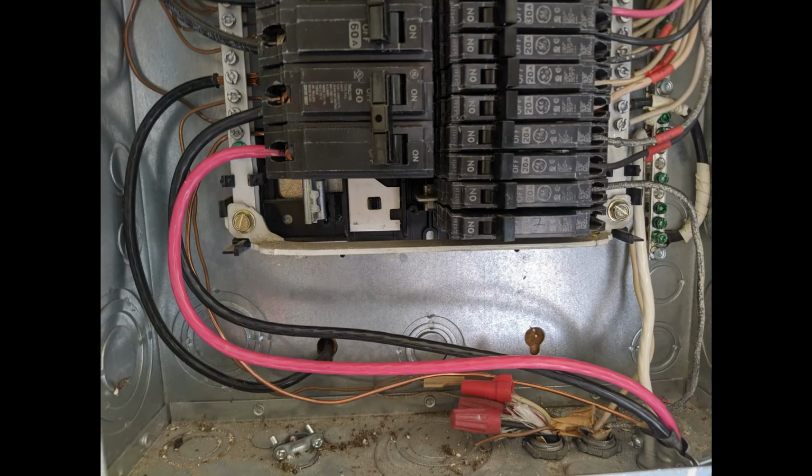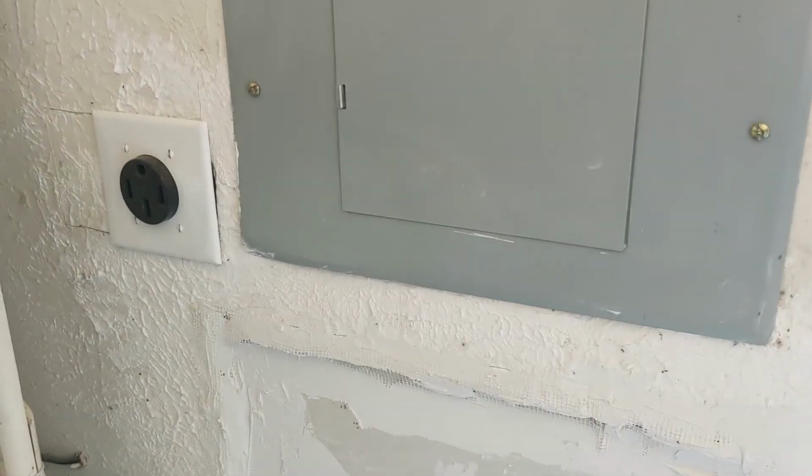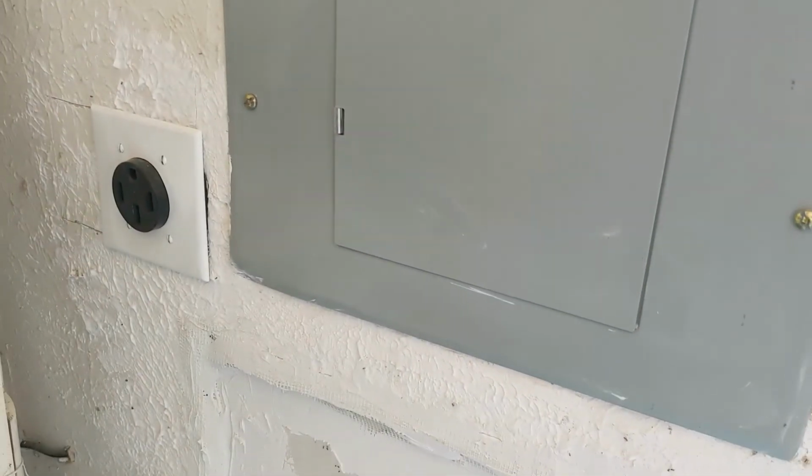I've got pictures that I can show you of what it looks like installed in the box. Pretty simple to do. That 8-gauge wire is pretty tough to work with. Three conductor, but there's also an additional ground. They kind of ignore the ground in the count. So it was an 8/3, I believe, whichever way. Look for 4 conductor wire, 1 ground, and three normal conductors to be able to handle both sides of your 120, and then wire it in.